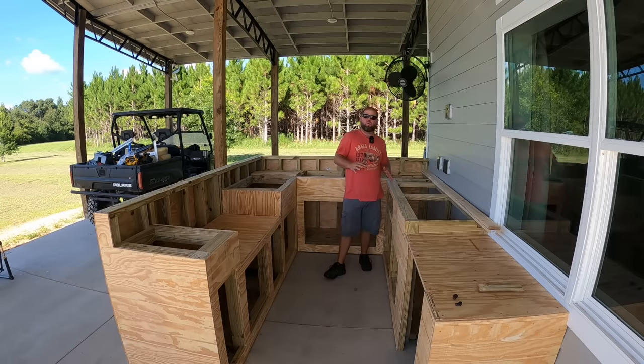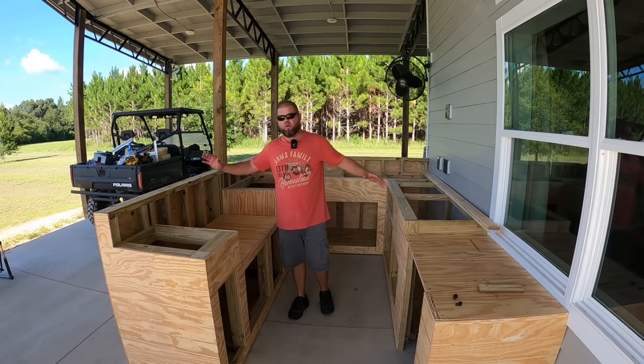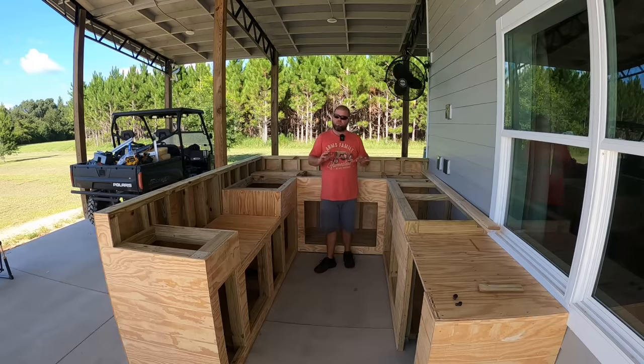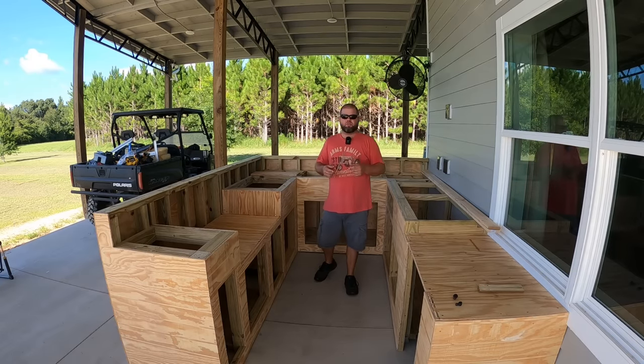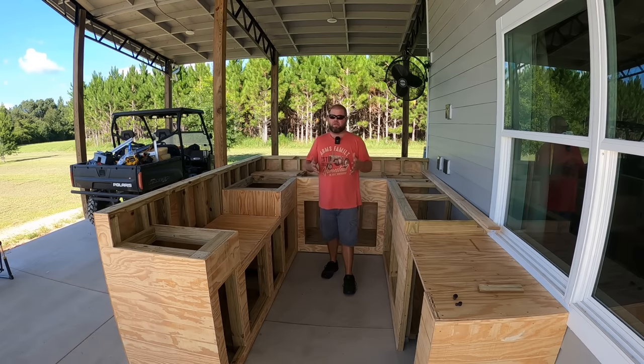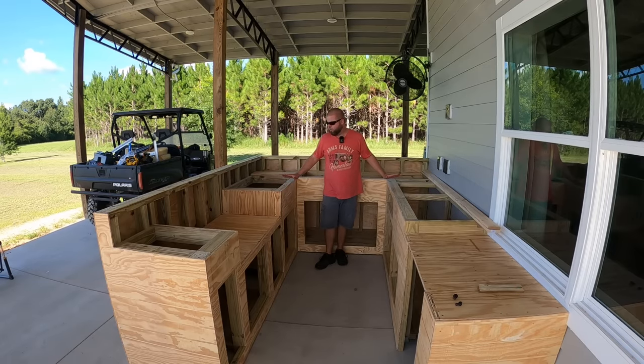It's been a heck of a long day — I think this is where we're going to knock this episode off. Made really good progress. We've got our Blackstone area completely notched out and ready to go, all the sheathing's done, the countertop bracing, everything's ready to go — bottom shelves too, completely forgot about them. So what we're going to do in the next episode is go ahead and get the plywood on for the countertops, basically just start prepping everything. We may go ahead and install those in the next episode as well. We'll also have to set up our bar top. We're putting all the sheathing down — three-quarter-inch plywood — and then half-inch tile backer board, basically a concrete board material, on top of that. So we're making an extremely rigid countertop for the tile to sit on, so we should hopefully never have any issues with grout lines or the tile itself cracking.